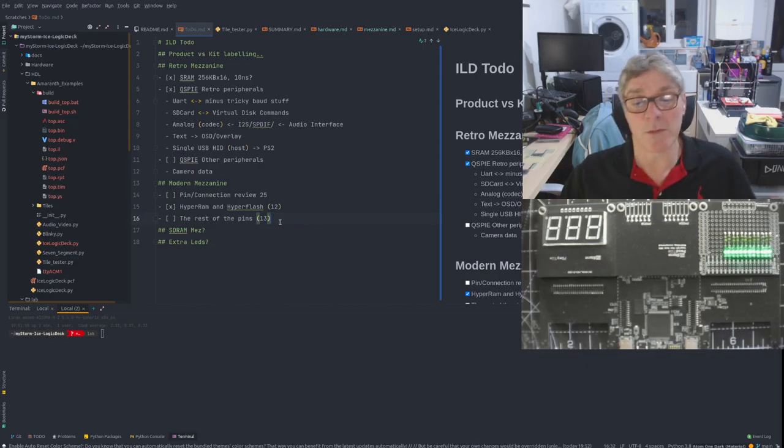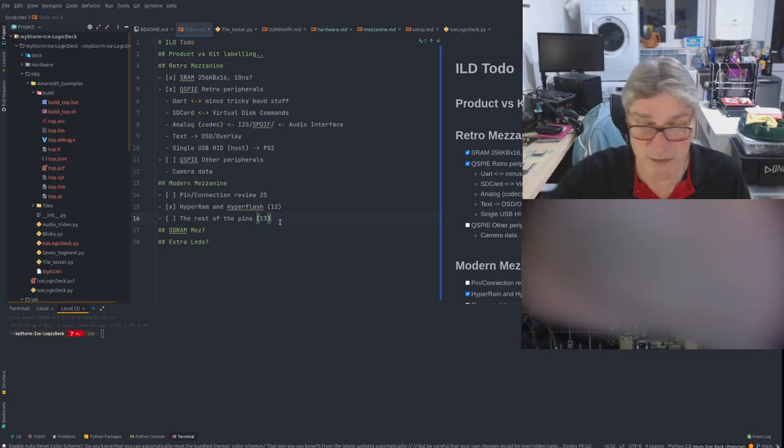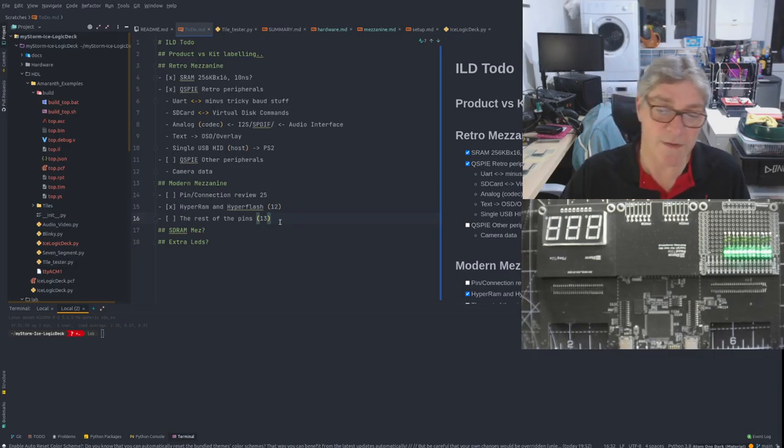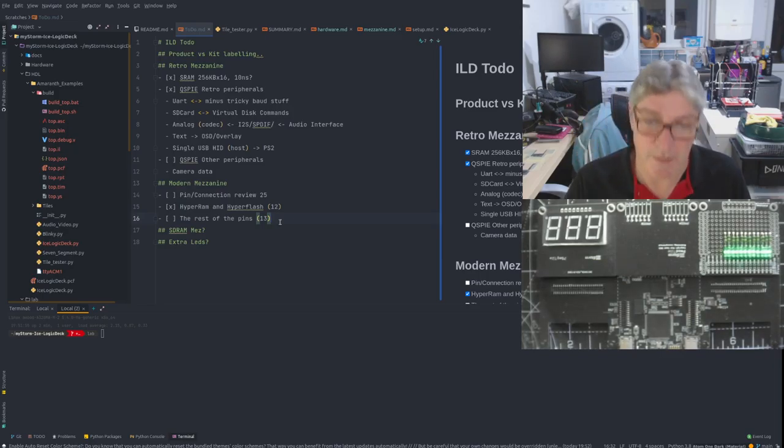Why would that be useful? Well, we may have an LCD tile that we talk to. So in that case, the FPGA is just passing that through. Or in another case, even though we've got an LCD-like interface from the ESP point of view, it could actually output that to a VGA or an HDMI display. So it enables us to do stuff from the ESP32 that appears on those displays. Or it goes the other way around. If we had a camera, then we could bring an image in over those pins.